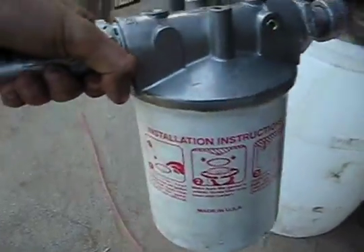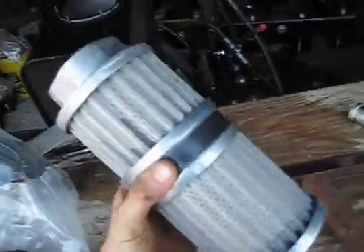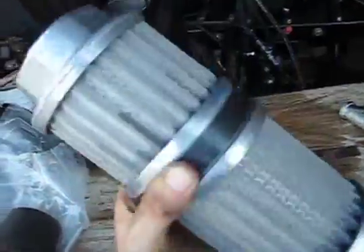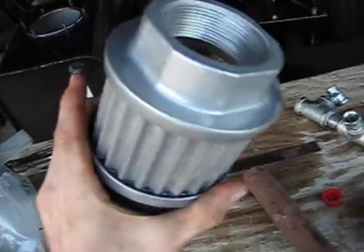Here's the hydraulic tank to be mounted, and here's the 10 micron filter for the return line. We're going to have to go inside and mount a suction strainer. Here's the suction strainer — it's got a magnetic strip in the middle to catch particles of metal.